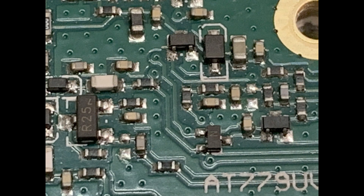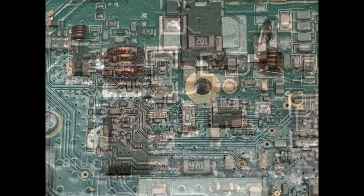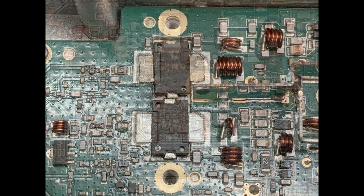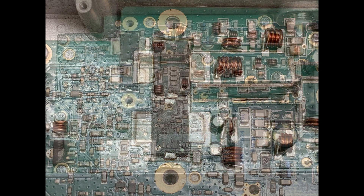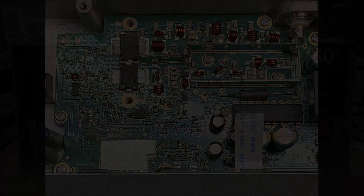There's a microprocessor that's a through-hole part — kind of interesting, since everything else is surface mount. All the radio stuff is elsewhere; I don't know these chipsets but it looks pretty straightforward. There are two main FETs that are the RF amplifiers. There's a pre-driver on the far left, and then a UHF and a VHF section for the power amplifier, and UHF/VHF sections for the filtering.